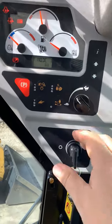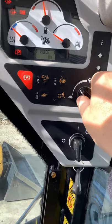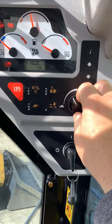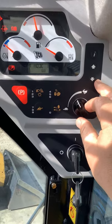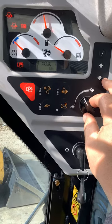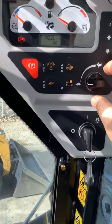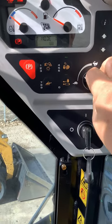You may notice that if you did leave this in a mid position and turned it off and back on, and you're trying to get moving and do your work — you turn this or you're using the foot throttle down here, you're giving it gas, and nothing's happening. That's because JCB has an override to take your RPMs all the way down to idle no matter where this control is set when you first turn the machine on — it basically kills power to this dial. What you need to do to get it working again is turn it all the way back to turtle. That'll re-synchronize this knob, and then you can either give it foot throttle or turn the hand throttle and it will respond.